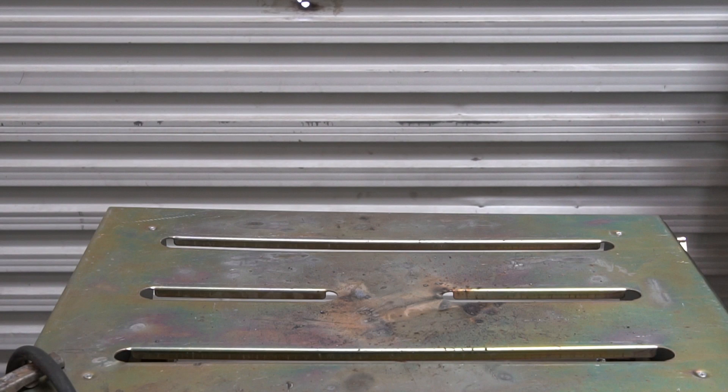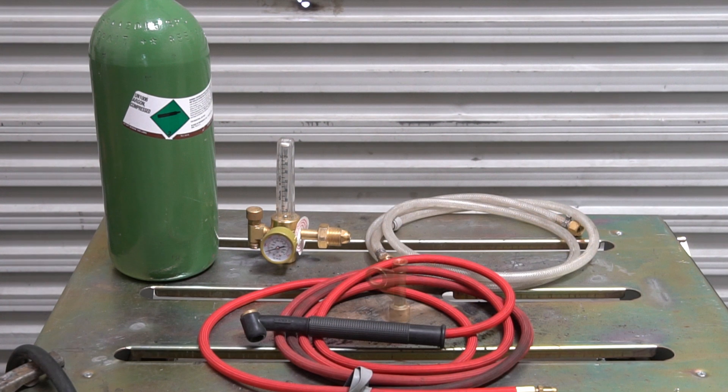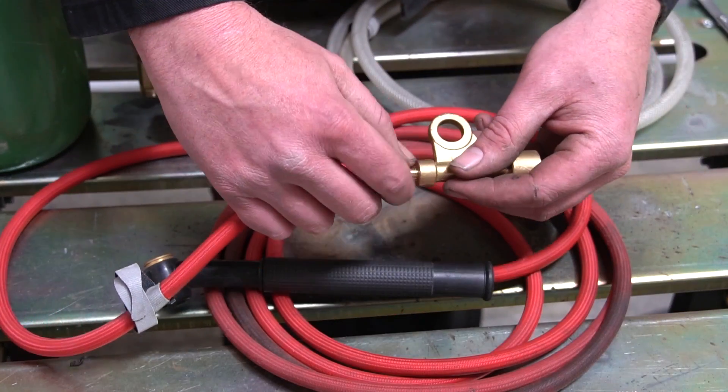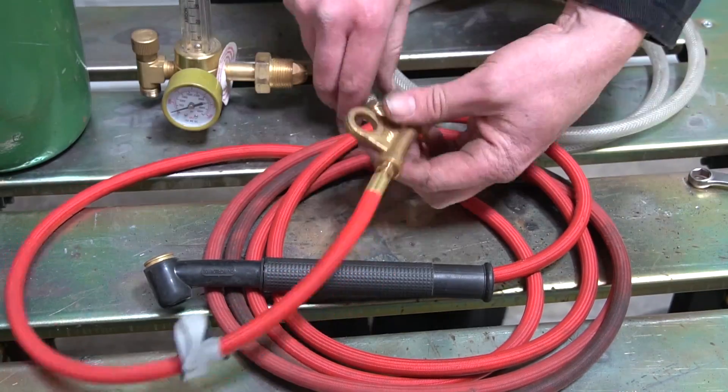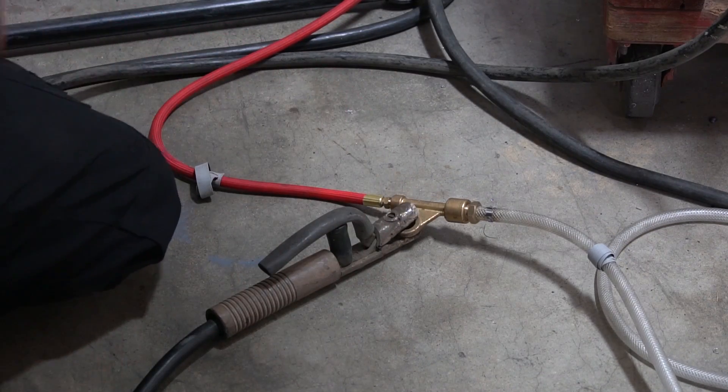Speaking of TIG, here is everything you need to turn your arc welder into a TIG welder, starting with the argon. We use 100% argon as our shielding gas — nothing more, nothing less. You'll also need a flow meter, a hose, a torch, and a power lug — sometimes known as a power adapter or an arc-to-TIG adapter. There's a link in the description and it costs eight bucks. The full assembly is straightforward: the TIG torch line connects to one side of the power lug, the hose connects to the other side, and we connect our stinger to the power lug to supply power. It's now set up and ready for scratch start TIG welding.